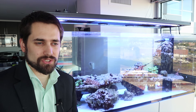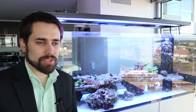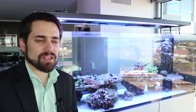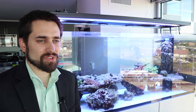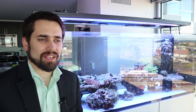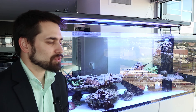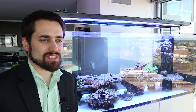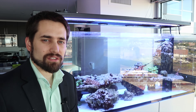So I went to a lot of sites and researched stray voltage in aquariums. There's always some sort of voltage in the aquarium when you have magnetic pumps, because the magnetic coupling enables the voltage to be carried through the tank. Typically this isn't a problem for fish because they're not grounded — it's just voltage emanating from the pumps. You could have 20 or 40 volts AC in a tank with a lot of pumps, and it might not be a problem if it's just this voltage magnetically coupled through the tank.